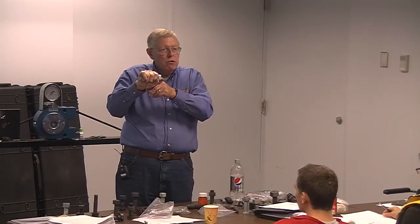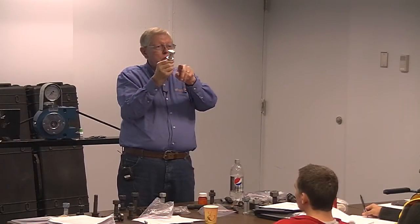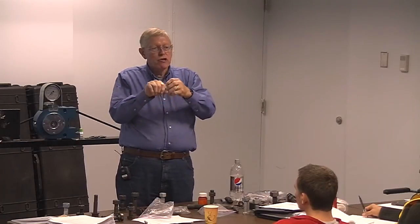There was a job on the Ohio River in the Cincinnati area, and I was asked to comment on some of it because they were looking at rotational capacity tests. They were having dry fasteners during the rotational capacity test, but then they told me they installed everything with the bolt heads out. On a galvanized bolt, how do you solve the problem of bringing your torque down? Any comments, any ideas? What do you lubricate? The washers, exactly, because that's the easiest piece to lubricate. It takes the least amount of lubricant. You don't want to stick your bolts in and lubricate the whole bolt when all you need is the turning surface lubricated. So you lubricate the washers.